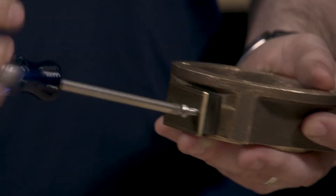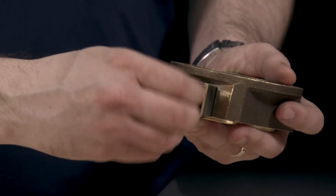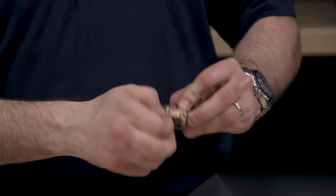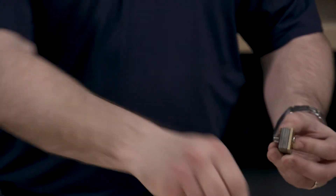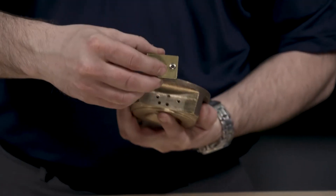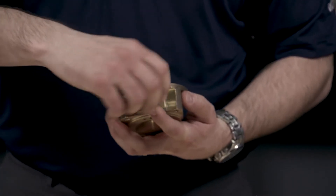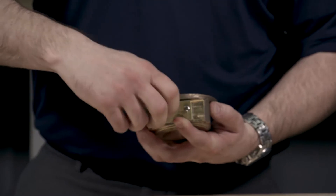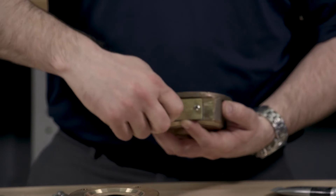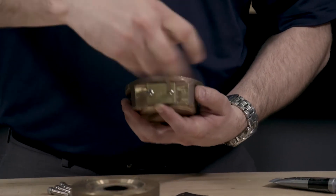Remove the anti-flood device from the housing of the accelerator. With each of the parts included in the repair kit now removed, we can now start to install the new parts into the accelerator. The first part we will install is the new anti-flood kit into the housing of the accelerator. Do not disassemble the anti-flood device as it will be very difficult to put back together in the proper sequence. When installing the new anti-flood kit, make sure the Viking logo is in the upright position.